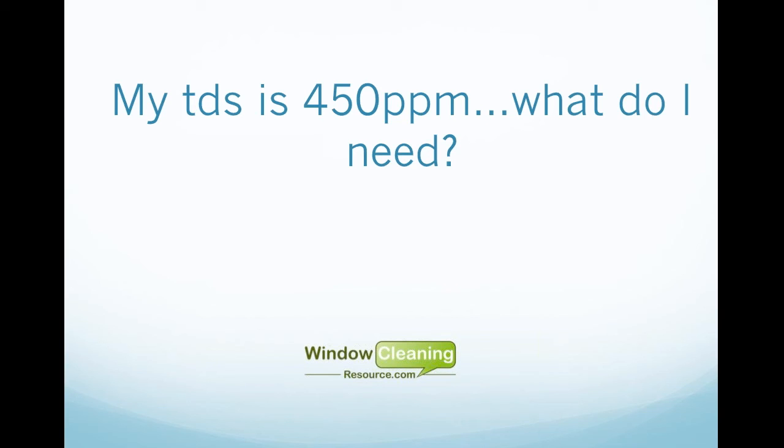But if your company is only using the system a few times a year or once a month, then that may be a route to go. You just replace the resin. That's the cheapest way to go. If you're going to be using pure water on a regular basis, then you would want to invest. Like I said, it would be a more costly initial investment, but in the long run, it would save you money. You would want to invest in a 3 or 4 stage RO DI system with TDS at that high of a level.